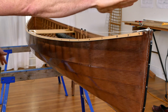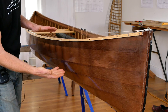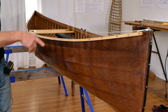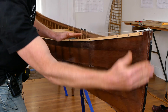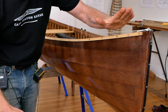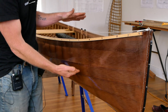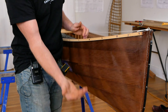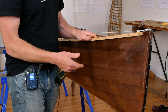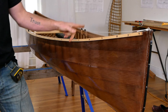Zooming out a little bit, the shear curve I chose for this boat is just the standard shear I use for all my canoes — a good compromise between windage while still keeping the ends high enough to keep waves from coming in over the bow. For this particular canoe, I did something I've only done before in larger canoes with recurving stems: I added some additional wedges to the top of the gunnels to sweep the ends up a little bit more. In such a shallow canoe, a little bit of extra sweep towards the end is going to keep green water from coming over the bow if you're heading into a really steep chop. I'll do this in the bow in the future but not the stern, as it's not necessary there.